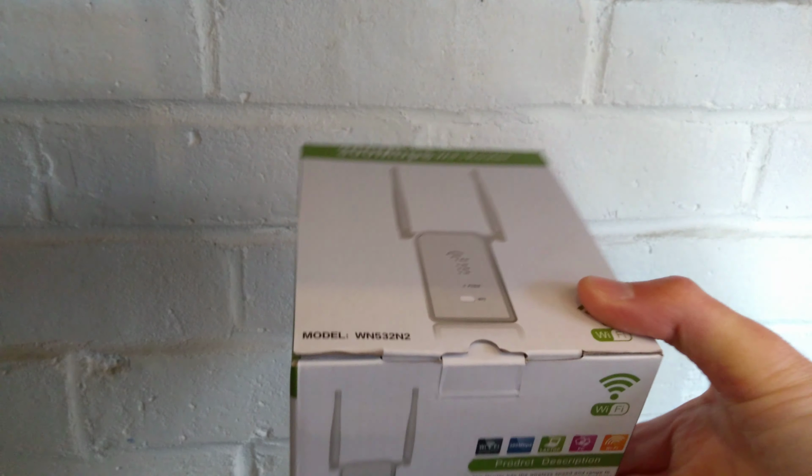I'm interested to see how much power it draws, so I'll move it over to my electric socket. So here goes, let's plug it in and see what we get. Might also help if I switch it on at the physical switch. Half a watt, pretty good at the moment. We'll see whether it goes up. Can't quite tell if that's 1.5 watts. I think that may have been, yeah, 2.5 watts now. It's booting up. There we go, 2 watts, and I presume that's now in its standard functional mode. So I'll now move on to the computer and have a look at the web interface.